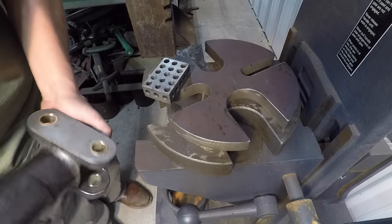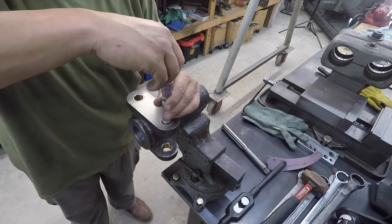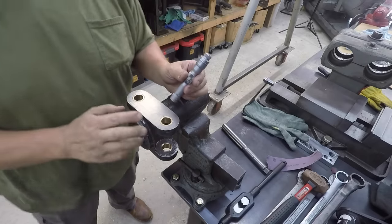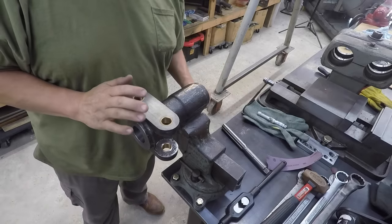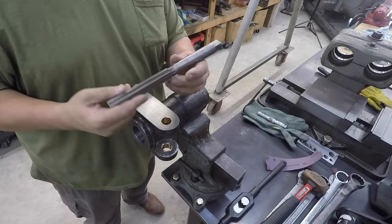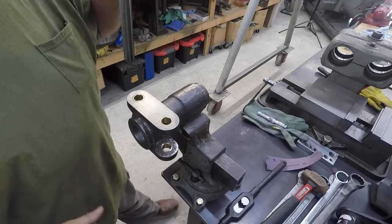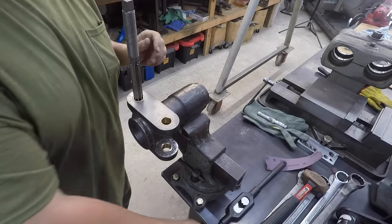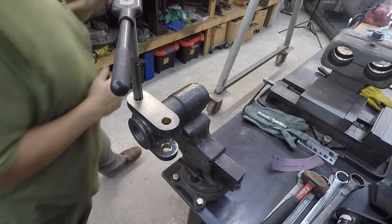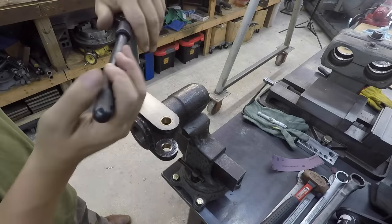We are just about done. I was doing some checking after I pressed them in with the calipers — it looked like they were slightly undersized. So I'm checking them with my bore mic right here, and we're definitely a thousandth to a thousandth-and-a-half undersized. I don't want that to give Eric problems with cutting a standard-size pin to fit in there and it being tight. So I found one of my hand reamers — this is a 7/8-diameter hand reamer — and we're going to use this to ream it to size, just use a tap wrench on this guy. This should bring it right to the size that we want; we're only going to be skinning about a thousandth out of it.